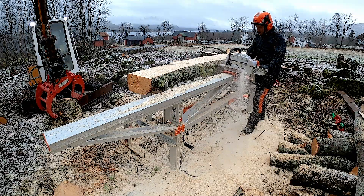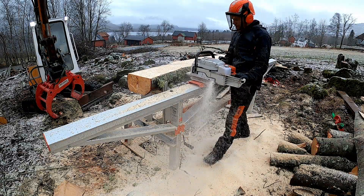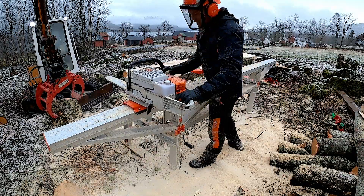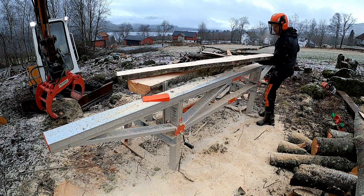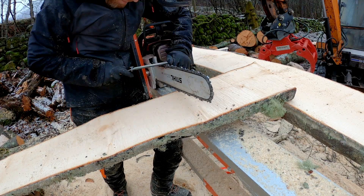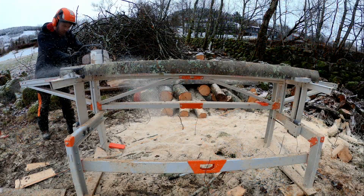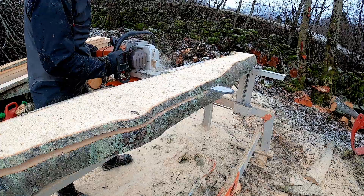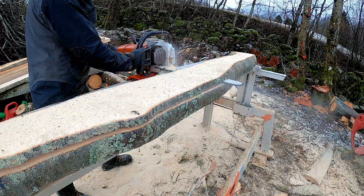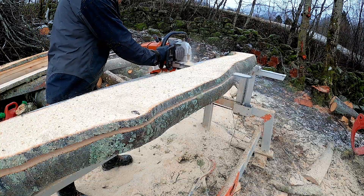Later on I'll show you when I sharpen it and what it looks like after sharpening and how it performs. I used some wedges in the beginning but after a while I found that most of the logs didn't really need them. Another thing I need to get used to is sharpening the saw in the field — the saw is quite heavy and has the saw carriage attached, so it's a bit cumbersome to sharpen. Any tips you have are quite welcome. Here you can see the speed after it's been sharpened — not super sharp here either, but it gives you an idea of what the speed is.